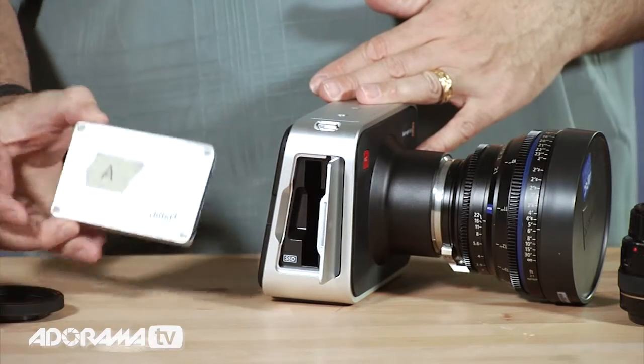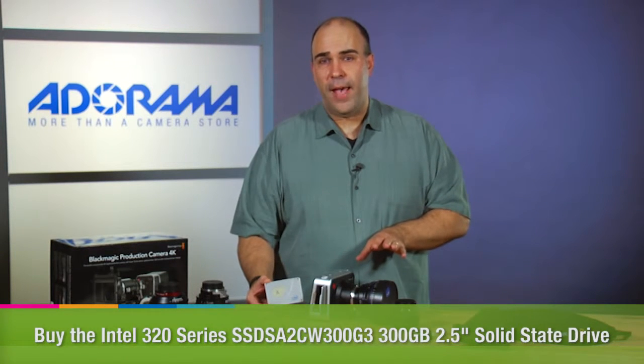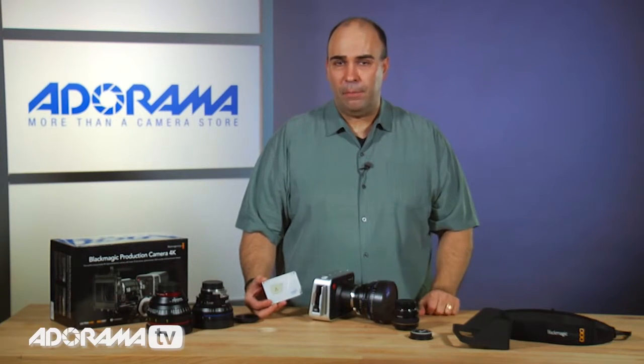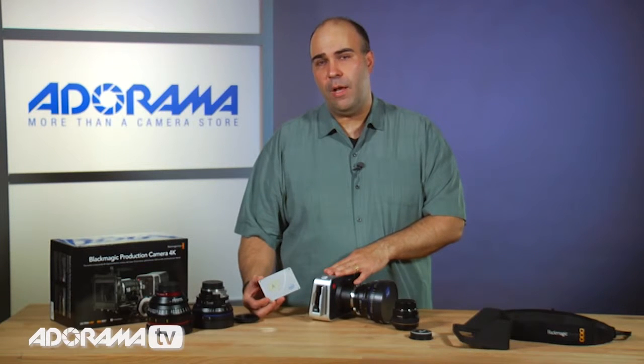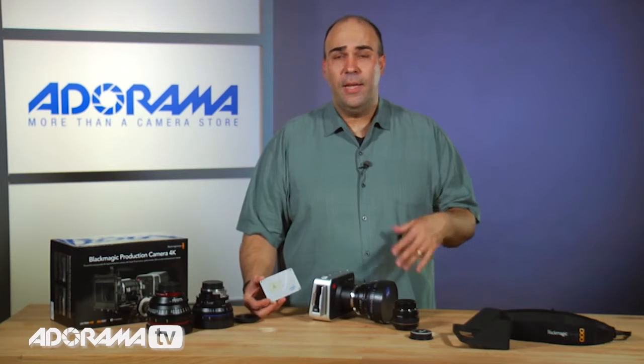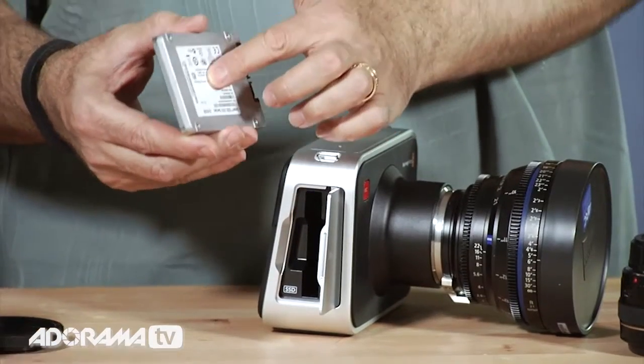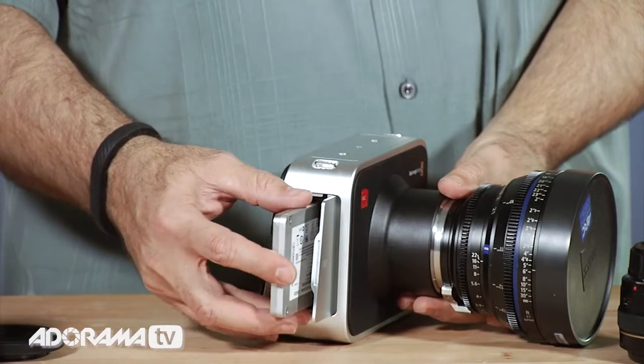For storage, this goes to really fast storage. Just open up that compartment — you're going to use SSDs, solid-state discs. These are very fast. Think of these as essentially being ultimate compact flash cards, and these are the same ones that you could buy to put in a computer. I recommend you look at the Blackmagic Design website; they do have some recommendations on brands and capacities that have been tested and work well with the camera, because you are capturing 4K video in the Apple ProRes HQ codec. Down the line, it's expected that this will also add the ability to work with raw files — Cinema DNG raw files — which give you even more file size and flexibility because it's raw video, much like raw photography where you have flexibility with exposure. Line up the back label and the teeth towards the front of the camera and simply gently push the SSD in, close that, and you're all set to record.